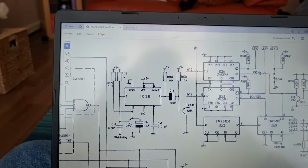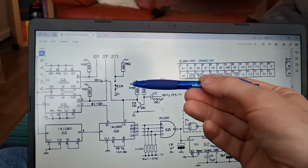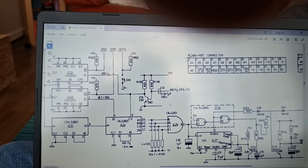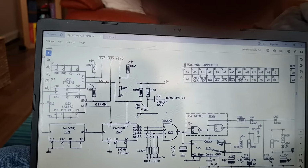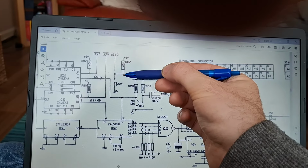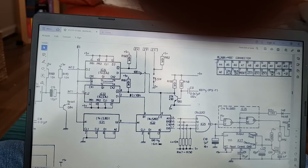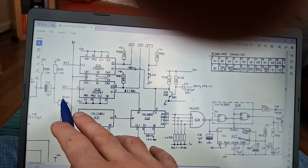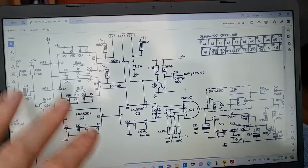And I know the purists don't like messing with boards, but if this was my own board, see that absolutely useless level 3 interrupt switch, which I don't know why they leave it on. Why would you want to turn the game up? I don't know. It's a software reset, okay? But what I would do with said software reset here is tie a link from the bottom of this 10K to here. So when you switch this reset off, you're actually doing a hardware reset. For testing anyway.